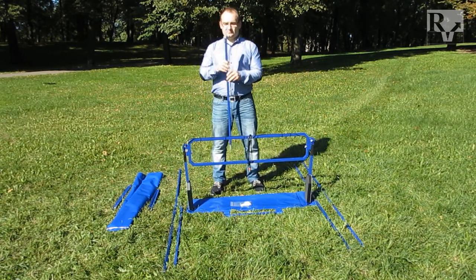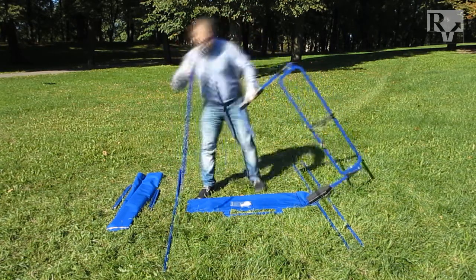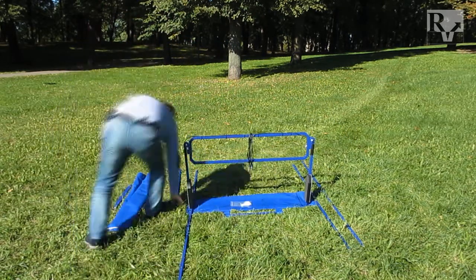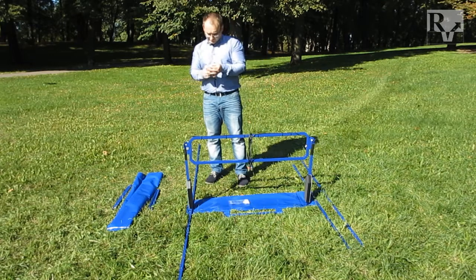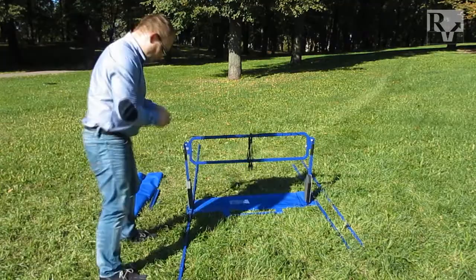To assemble the lowest 35 MHz setup, you need to connect a 1 m dipole with a 1 m extender to each side of the antennas. For this setup, you also need to fix the dipoles with ropes.